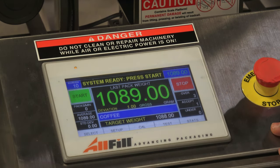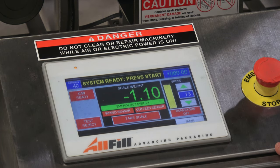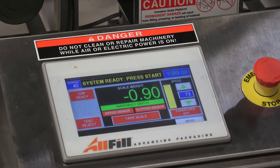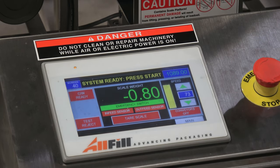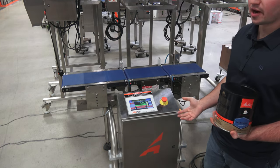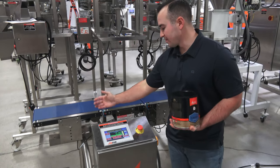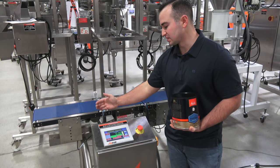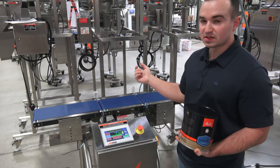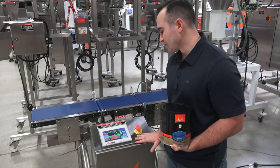From the main menu, one of the last screens to cover is the test menu. This is where you can run additional troubleshooting features — you can test your reject and make sure it's firing by hitting that button. There's also a live scale readout; if I put the coffee can on, you can see it reads a weight. In a dusty environment, the checkweigher might not get readings if the photo-eyes are blocked by dust — if I wave my hand in front of the in-feed sensor, you can see the button lights up green. Same with the outfeed sensor. I can also turn the conveyors on, test the speed, and with a tachometer verify it's reading 73 feet per minute as advertised.